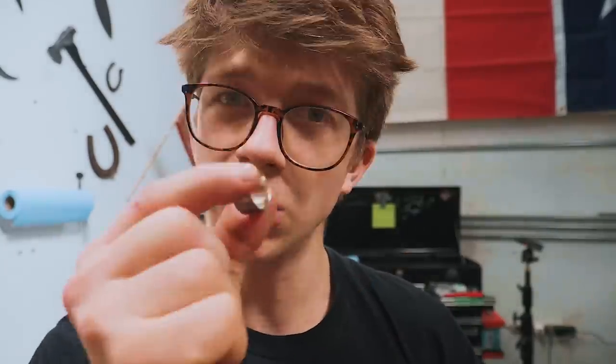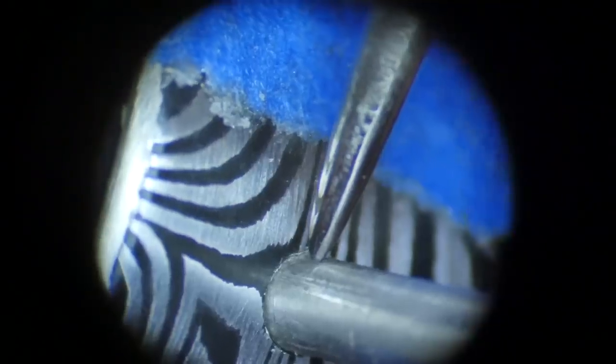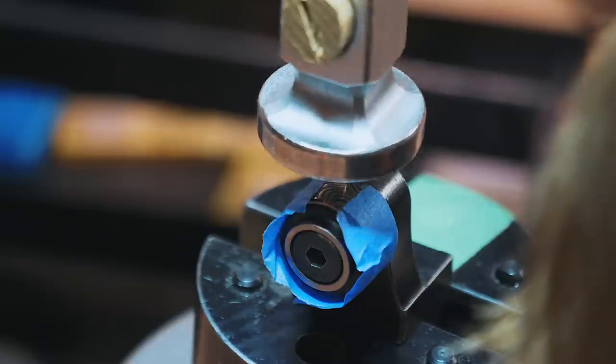It's now time to set a gem Pablo Sumo de Villa style, the way he taught me when I was doing the Viking sword. I'm going to take a piece of silver wire, hammer it in the top, bore into the silver, and do a bezel tube setting. I've got it taped up to protect it, widened a little more with a ball burr, put the wire in, marked where I want to cut, then dropped it in the hole to set it with a hammer — hopefully without hitting the nicely finished Damascus.